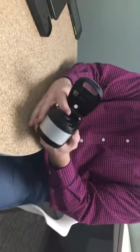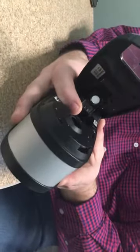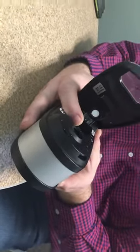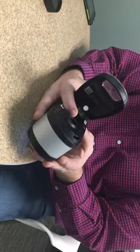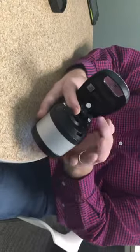How I usually explain the calibration standards: you see this little white tile here. Think about that as like a $500 pair of sunglasses. Sounds a little odd, but that's how I usually talk about it. So how would you clean a $500 pair of sunglasses? You most definitely wouldn't go out to the press room and grab a shop rag and clean your glasses that way. You probably wouldn't grab your shirt sleeve and clean your $500 pair of Ray-Bans that way. You would probably grab lens cleaners or clean cotton cloths — things designed specifically for those glasses. Same thing as that calibration standard.